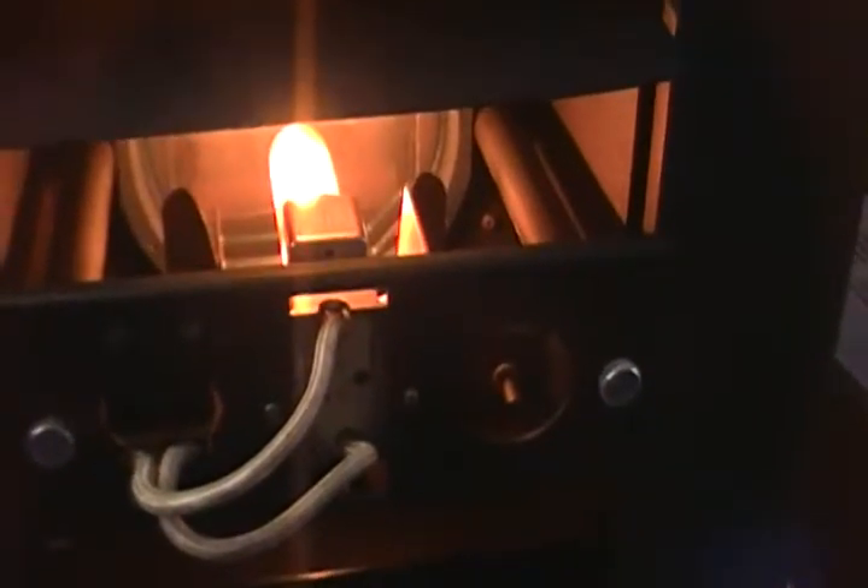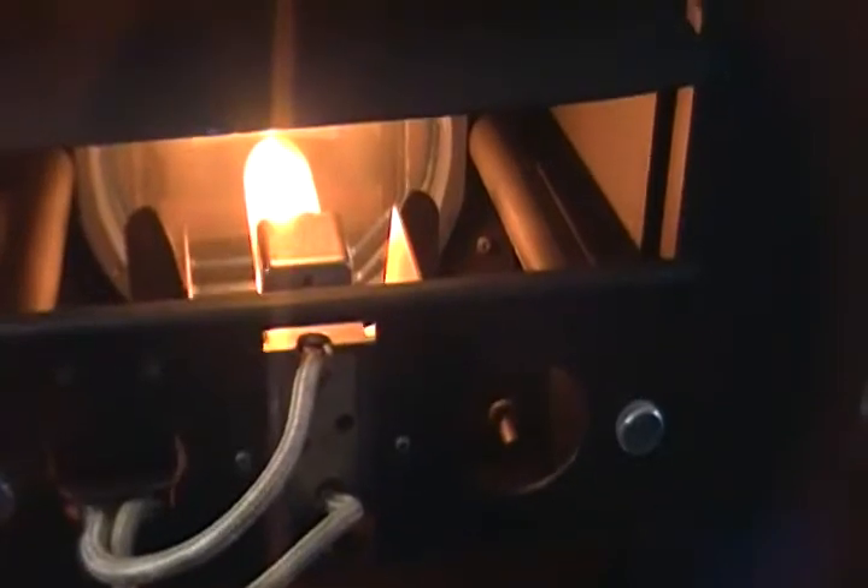The lamp is in what we call the standby glow state. This standby glow state basically has a minimal amount of power going to the lamp, and what it does is it allows the lamp to come on afterwards and come up to the correct 3200K Kelvin temperature and brightness without having to start from a cold start.